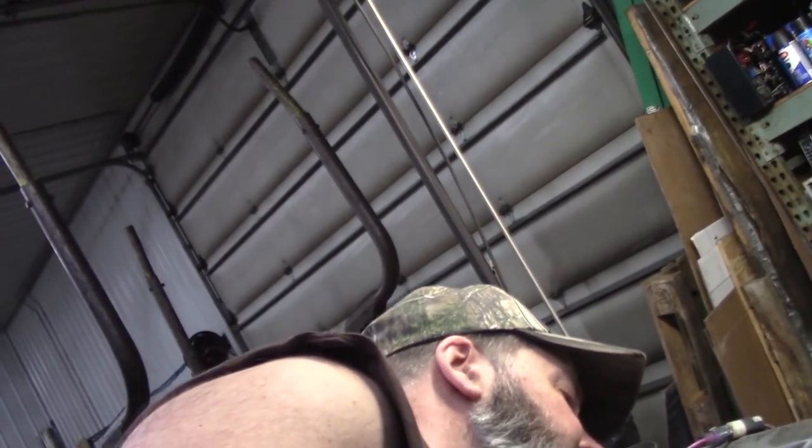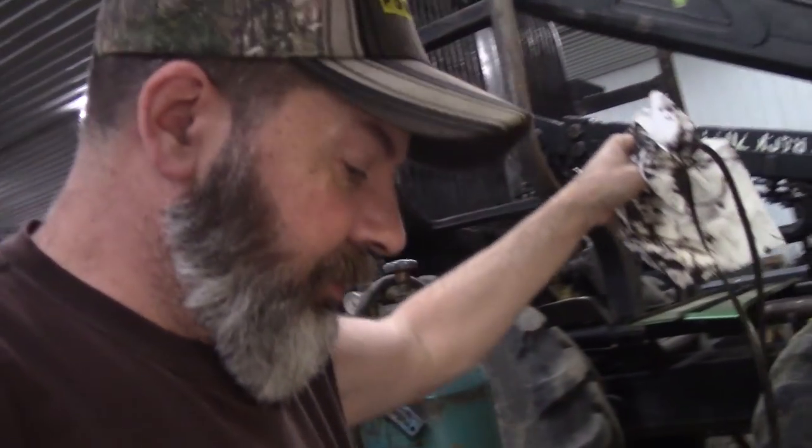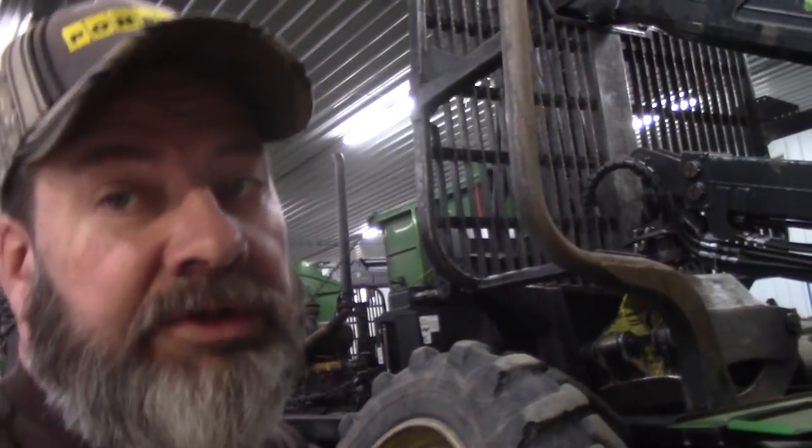I'm going to shut up and go clean up now. So I hope you learned something — how to grease the bogey bearing. Push it in one side, let it come out the other side. Push it in one side, let it come out the other side. That's the best way. You want fresh grease in there? Push the dirt out the other hole. These guys go in the swamps, in the mud, in the whatever. Push that grease out the other hole — it'll give you a lot longer life out of it. To the garbage, and we will see you next time. See ya, bye!